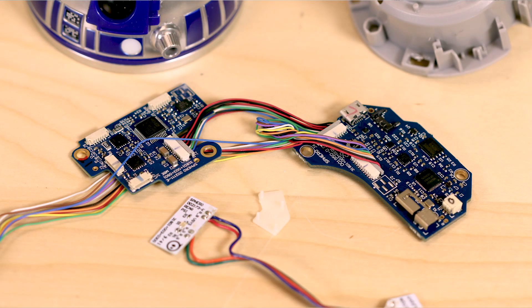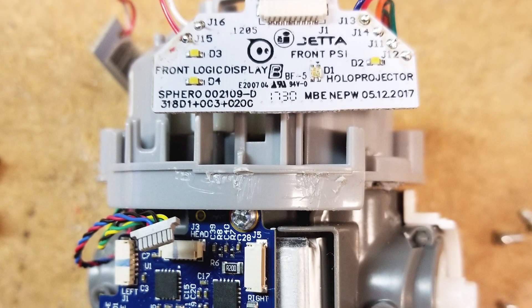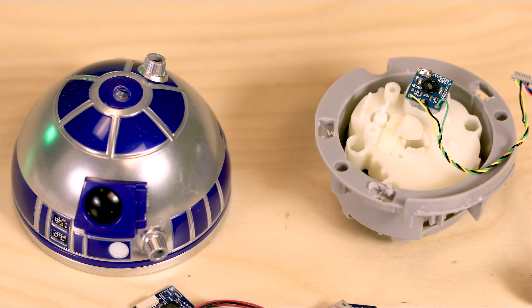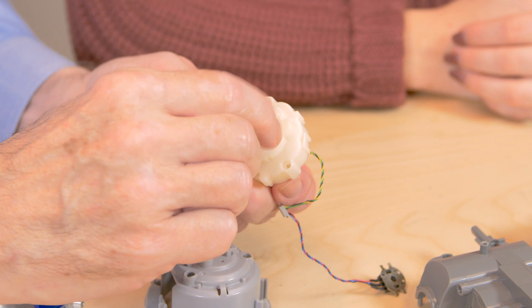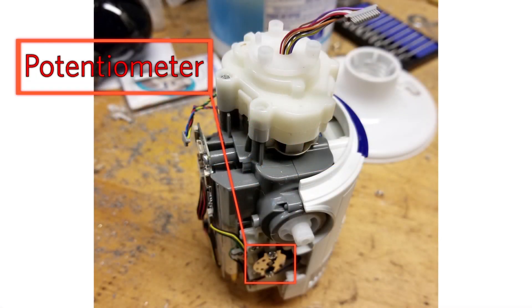With all the panels off, you can get a good view of the two main electronic boards and two smaller boards holding LEDs for R2's blinking dome lights. There's a piece to which the top dome panel attaches, fastened on with screws. Removing it reveals the servo motor that rotates the turret and a feedback encoder. The feedback encoder is interesting in that rather than being an incremental encoder, it's just a potentiometer — the motor controller senses the changing potentiometer resistance to decide how to rotate the motor shaft. There's a second potentiometric encoder on the main chassis that provides feedback about the position of the foot that extends to the ground from R2's body. The servo motor that moves the foot is the same one that angles the two arms into position to let the robot move around.